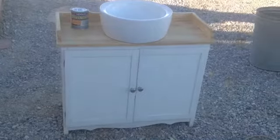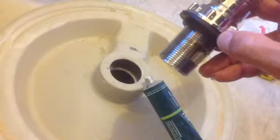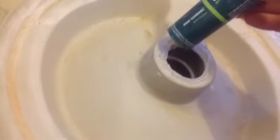It looks nice. Even though we cut some holes in the bottom, it looks nice. So here we are in the bathroom, ready to attach the sink to the wood countertop. First thing we're going to do is put the drain assembly in. That means you have to put a little bit of silicone around the bottom edge, and also in the inside of the sink where the other part matches. We're going to put silicone on both sides of the hole — the bottom hole and the top hole.